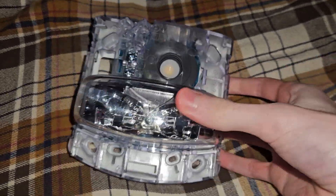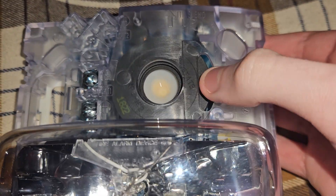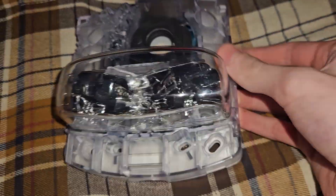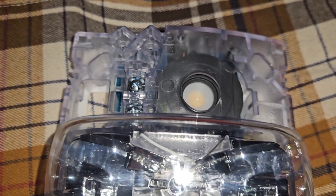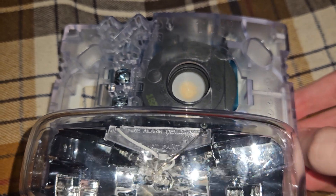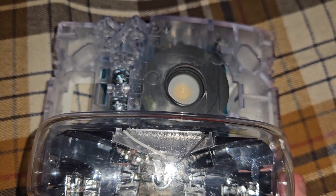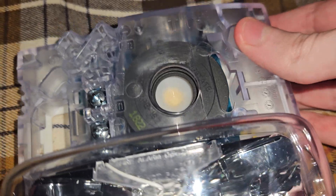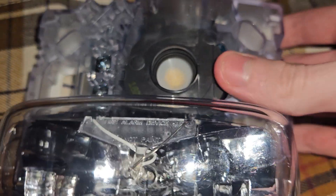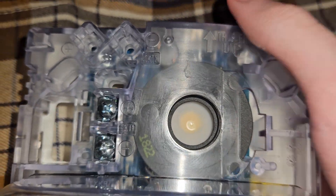Here is the whole assembly itself — this is really your circuitry and how to mount it. Here is your horn piezo. It is actually a King State KPE-G-182, which is used on most TrueAlerts, with the exception of the 4906-9137 and the 9138 multi-tone devices, as well as the TrueAlert chime strobes like the 9133, 9134, 9135, and 9136, which use a flat piezo.